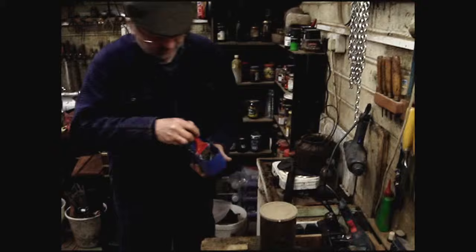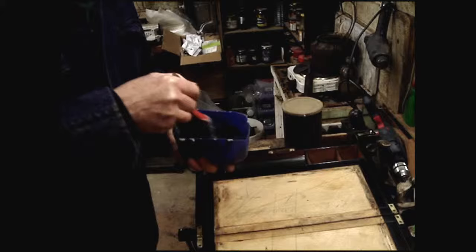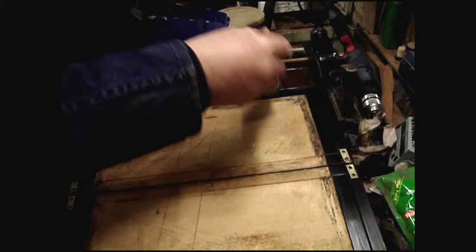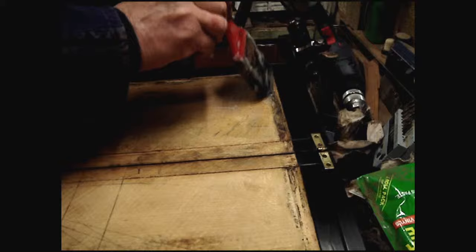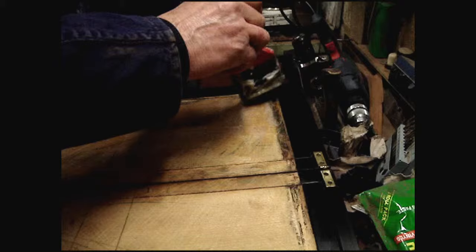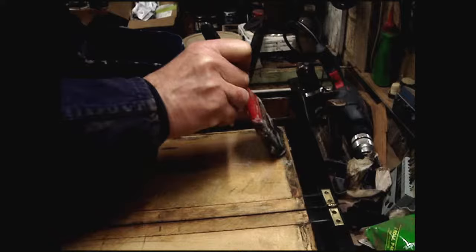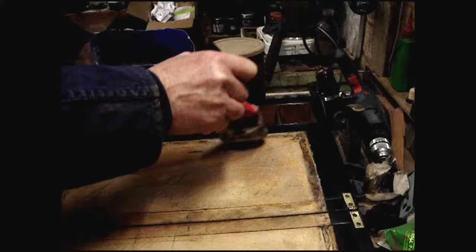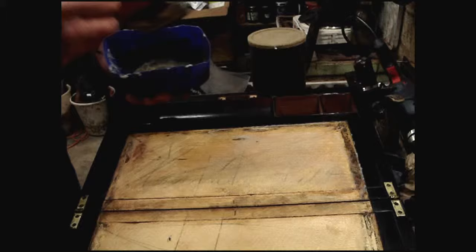If you leave it a while, you don't get those slightly dry lumps. Put the paste on reasonably thick — up to a sixteenth of an inch — and get it right up to the edge. With waxy veneers, if the glue gets squeezed out onto the veneer, it won't stick to the polish and rip it off when you clean it. Plus it's water washable, so any waste on the edge can be cleaned off either before or after it's dry.